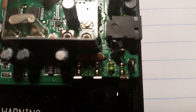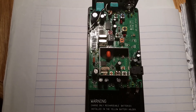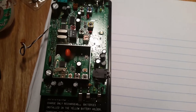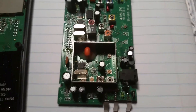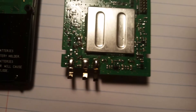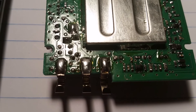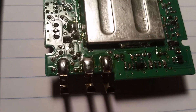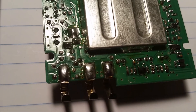There is something that's a little concerning. I'll take this off and show you the other side of the board. On inductor L18, on the flip side of this board, there are a few char marks. It's hard to see in the video, but right there — there's a little bit of charring. I'm not sure if that would produce the odd behavior this scanner is doing.